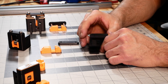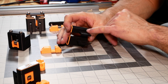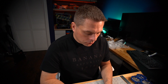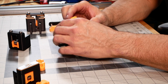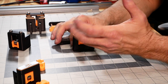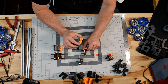Next problem: the mod as I found it — not saying there aren't others out there that don't have this — but it left the ridges in. These are great if you're using it on a 2.4 Voron, but the Trident doesn't need these belt locks whatsoever. It's easy to tell this was made for a 2.4 modified for a Trident, because it is missing the holes that the belt would slide through, but it still has some cutouts where that would be. So it's not exactly what I wanted. I was able to find a pinned version of the inner carriage through a gentleman who goes by the handle Fevered Mind, and I will leave a link in the description to facilitate using a pin mod on the beefy.